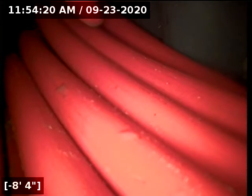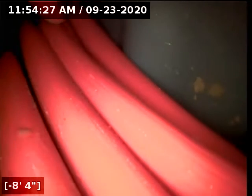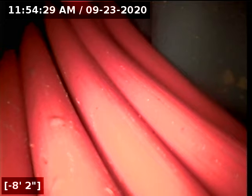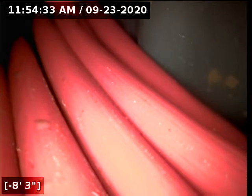That's why I was saying a belly of that nature in cast iron or concrete pipe, which have very rough pipe walls, is, in my opinion, a much more significant problem, because you can't take advantage of head pressure in the same way you can in plastic pipe, where those blockages don't always break loose on their own. And that's generally when you're dealing with just good old-fashioned toilet paper blockages. When you've got paper towels or tampons, stuff like that in the line, that's a different story altogether. Those things don't break down on their own and will often completely block and fill up on you.